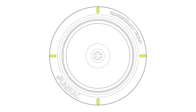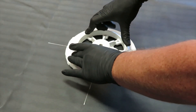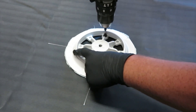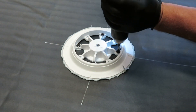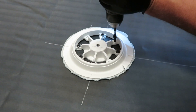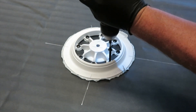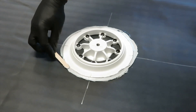Use indicator marks on the base to align FlashLockRM with centering marks on the roof. Then drive fasteners until the base is firmly secured to the roof and sealant squeezes out from the edge of the base. Be sure to use the type and quantity of fasteners specified by the project's structural engineer. Be careful not to over-tighten. Smooth the sealant around the edges.